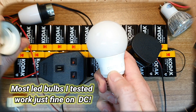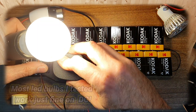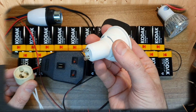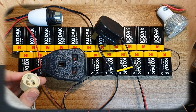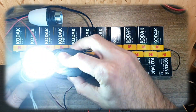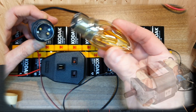A lot of the LED bulbs I've tested with a wide variety of voltages, and the brightness stays the same — it regulates and compensates for it inside. So for a very simple off-grid solution, I think a battery bank simply charged with a very simple charge controller, with batteries connected in series to give you approximately 250 up to 300 volts, and some carefully chosen appliances — you don't need an inverter at all. You only need it for traditional transformers and some types of motors like induction motors, but a lot of other 240 volt motors will run on DC just fine.